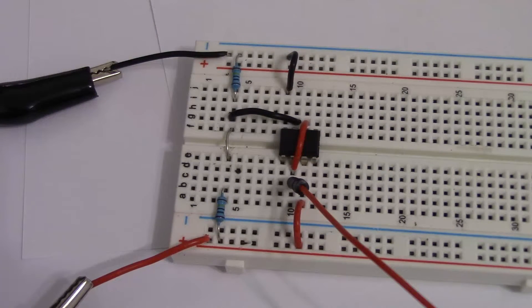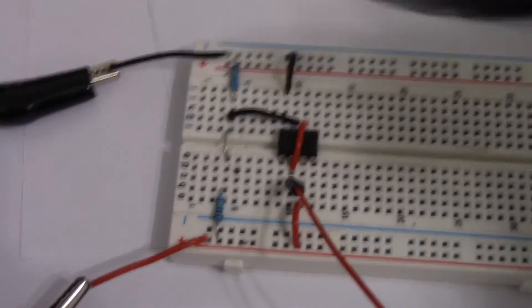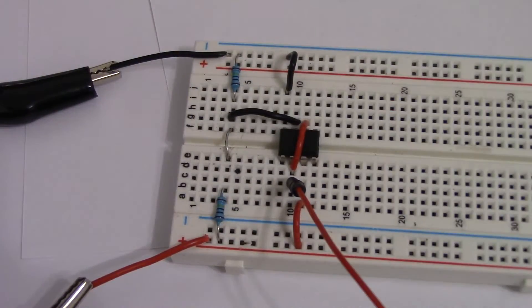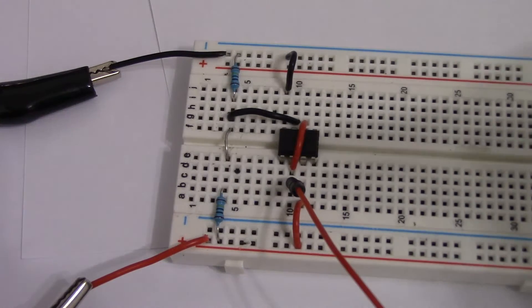To be meticulous with this project, I wanted to calculate the error from this power supply. These two leads provide 20 volts to the voltage divider, but when I measured the actual input voltage it turned out to be 19.79 volts — that's error built into my DC power supply. I also measured the 1k resistors: one measured 986 ohms and the other 985 ohms, so they're practically identical. The theoretical output from these values should be around 9.89 volts.